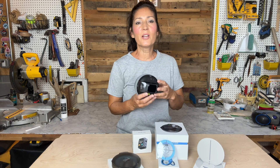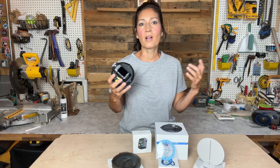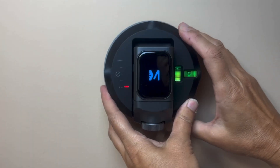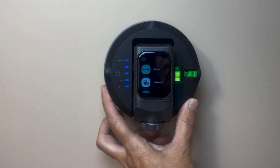This is an anti-gravity laser level which allows you to work hands-free and is designed for wall projects without the need for a tripod or to drive a nail into a wall. Like my other lasers, it attaches securely using a -55,000 Pa vacuum pump system, and it won't mark or damage surfaces.